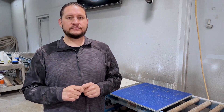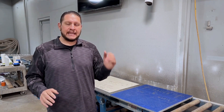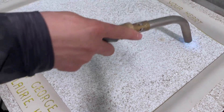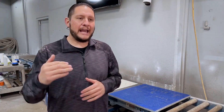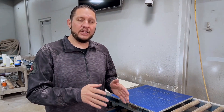Lastly, heat the stone. If you're having problems with blow-off, heat the stone. Whether you're using photoresist film, rubber, or stencil, heat is amazing. It causes the mask to pull down. The other thing it does is remove moisture. Even though you think the stone is dry, if you take a torch and put it on the stone, the first thing you're going to see is the top of that stone get wet from moisture. When we sandblast, we start heating up the stone, which draws the moisture up. So if you eliminate the moisture from the beginning, you eliminate your lift-offs or blow-offs in the future.